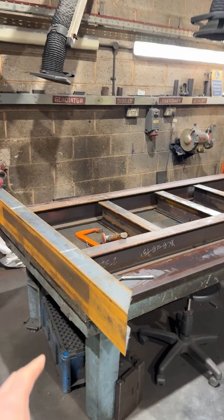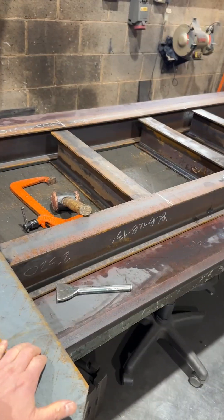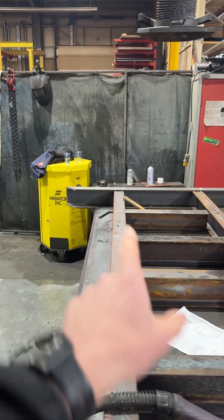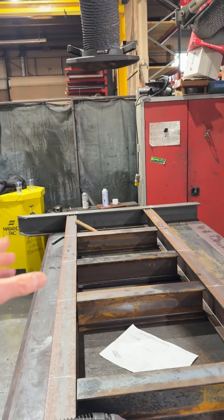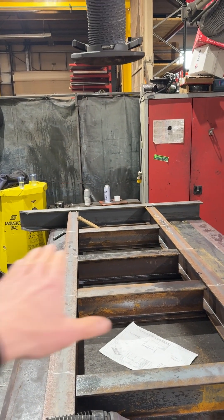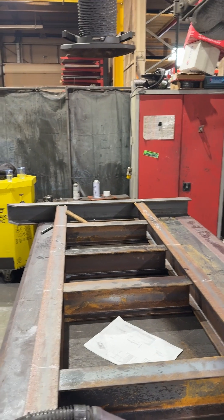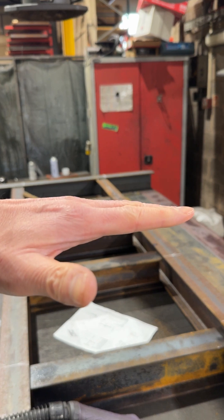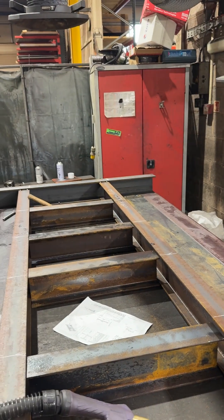Welcome to Digbit TV again. Quick video, short one about grading beams. One of the things with a grading beam is that these side skids act like skis. We see a lot of grading beams where the actual length of the side skid is pretty short, and that's not so great because the advantage of those is they're like a ski — they help to keep that beam on a flat angle rather than actually moving about when you're grading.